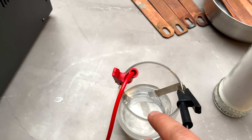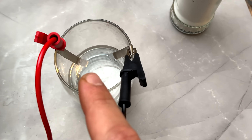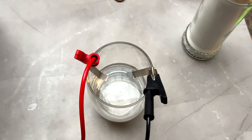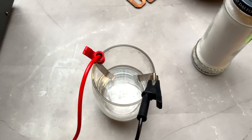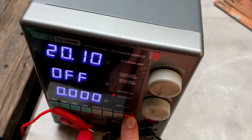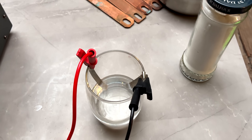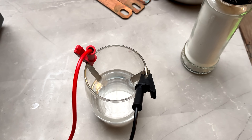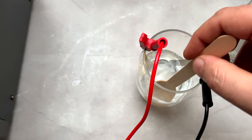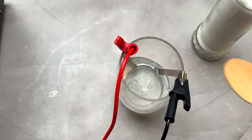What I have in here is just vinegar, with two nickel strips — one connected to the anode and one to the cathode. Positively charged ions from the positive side get attracted to the negatively charged side, fly through the vinegar, dissolve into the liquid, and you get this bright green or bluish color. Right now it's just pure vinegar, so if I turn on the power supply it draws almost no amps. I'll add some table salt to improve the conductivity of the vinegar and dissolve it with this wooden spoon.